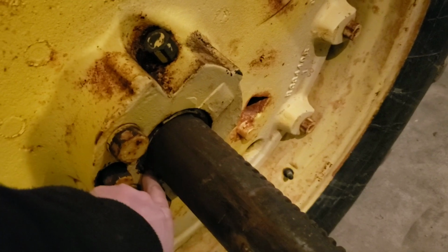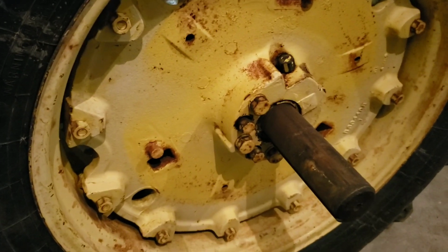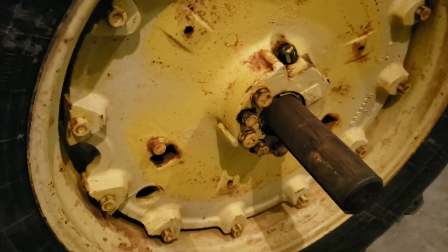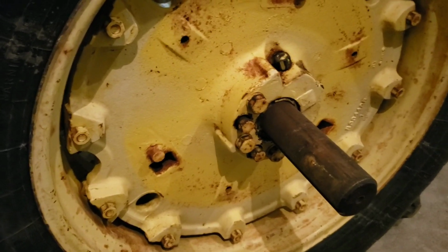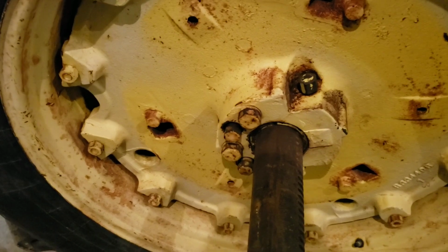And there are some tools that are made that slip over the axle like a half-cut pipe that'll go in there, and you can beat directly on the wedge. But driving a tractor around, they'll never actually ever break. Once they're set, they're set. You need to actually shock load it with a hammer. So we've moved quite a few old tractors that have probably never been set before, and really haven't had a whole lot of issues moving them if you do it right.